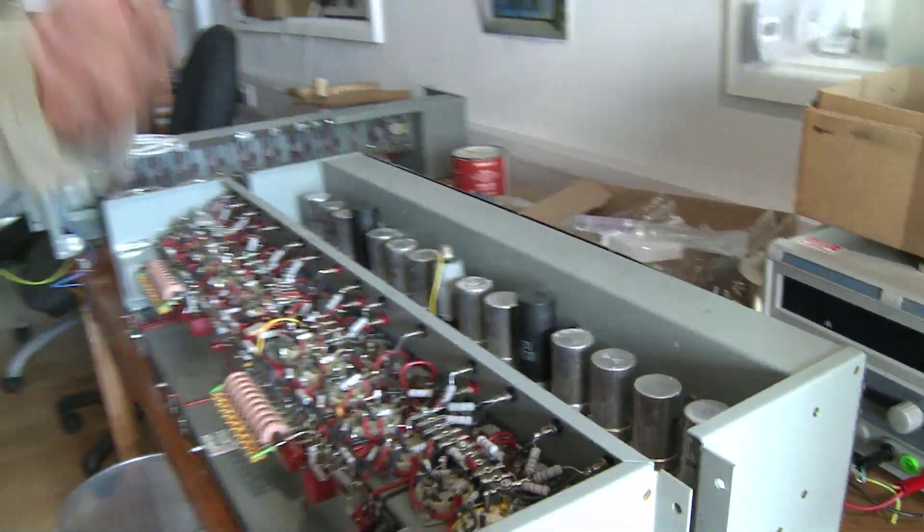So we're taking a break for lunch in quite an important meeting. We've now constructed several of the various subsystems that make up EDSAC and we're starting to run into issues as we connect these together. We're finding some of the signals aren't powerful enough to drive the circuits they're supposed to. We're finding some differences in interpretation, and some challenges with using old components that may not work as well as they did in 1949. These valves do die — we are getting a death rate amongst the components. A lot of these components are quite old; the little diodes have a date of like 1943 on some of the packets. So they've never been used, so they're new, but they're not really young.